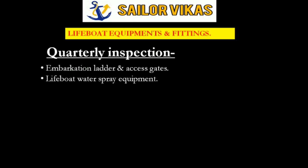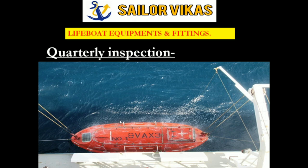The second thing for quarterly inspection is the lifeboat water spray equipment. So this we need to try out on a quarterly basis. Whenever we lower the lifeboat and maneuver the lifeboat, at that time we will try out the sprinkler system. Most of the sprinkler systems are clutched with the engine. So whenever you run the engine, the sprinkler will automatically start the moment you open one valve which connects the engine pump to the sprinkler. So this you have to try out.